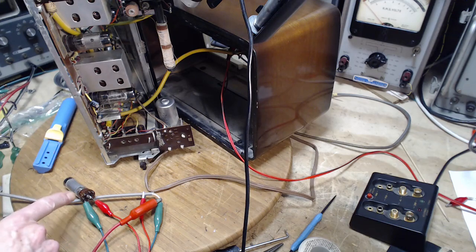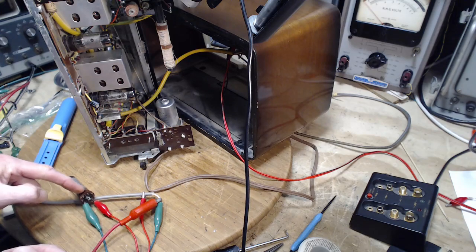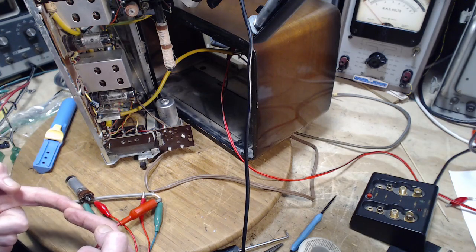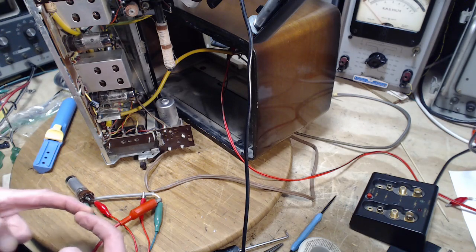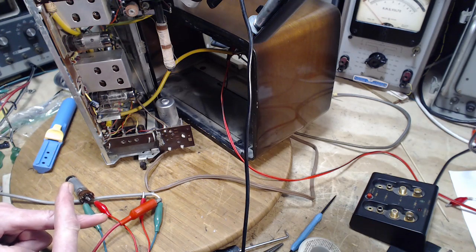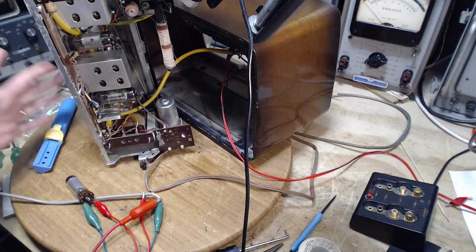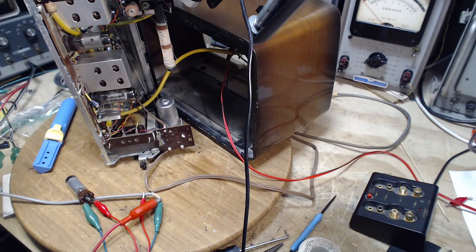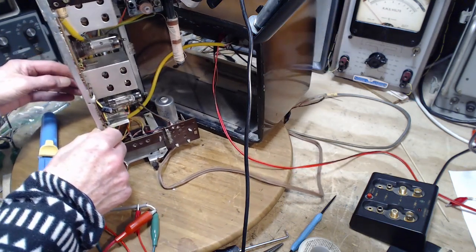So my theory on this is wrong. I thought this was two pieces of metal joined somehow inside here, and that the joint had come loose. That's a mechanical thing, and that's what was going on. No. So what is going on? All cold solder. I've resoldered this a couple times. It didn't seem to fix it at all. Thousands of microscopic breaks in the trace under the radio here. No, that just can't be the case. Just can't be.